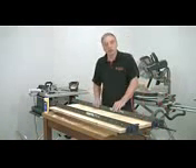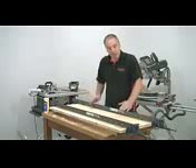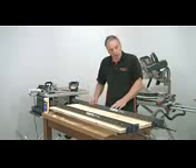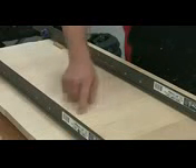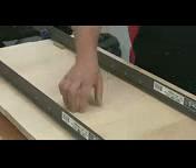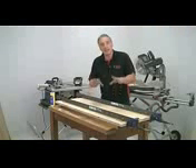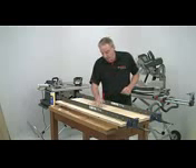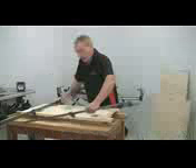That's the last one done — this is the one for the shelves. I'm lucky I have some really long clamps so I can do it as one piece. If you haven't got cramps as long as this just do it in several sections. It's always much less wasteful to do it in one long piece if you can and then chop out what you want. You also need to decide what you're going to do about the glue squeeze out — no matter how careful you are there's always a certain amount of glue that comes up from the joints. Some people say you should wipe it off with a damp cloth, but personally I prefer to leave it, let it dry and then just chisel it off. So here we are now some 24 hours later and everything is glued up.